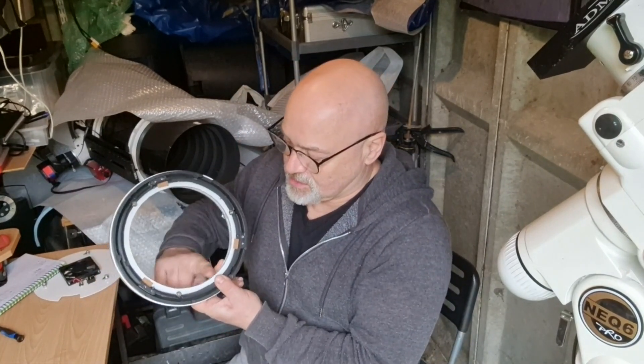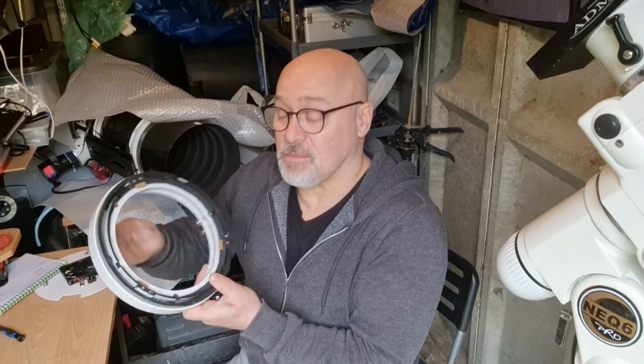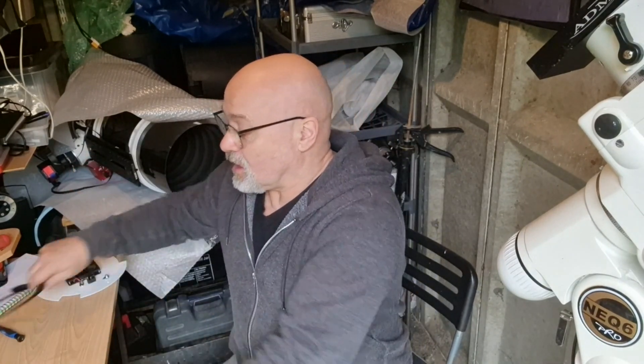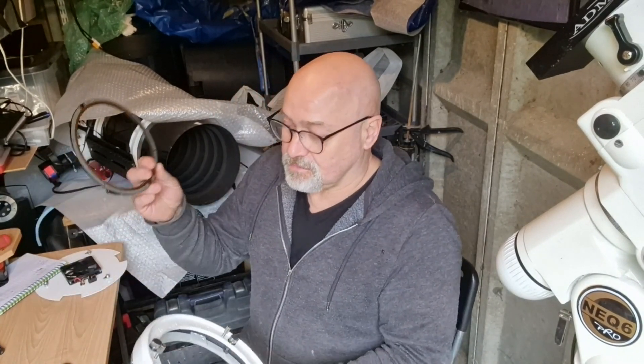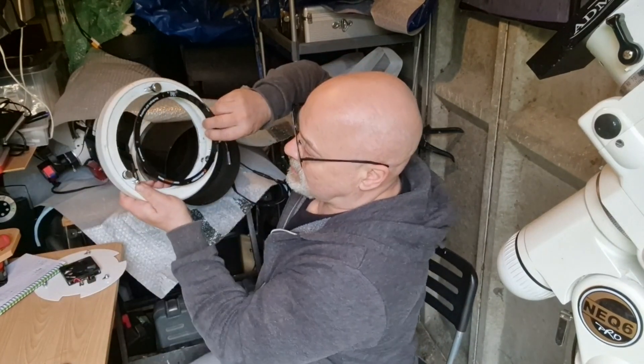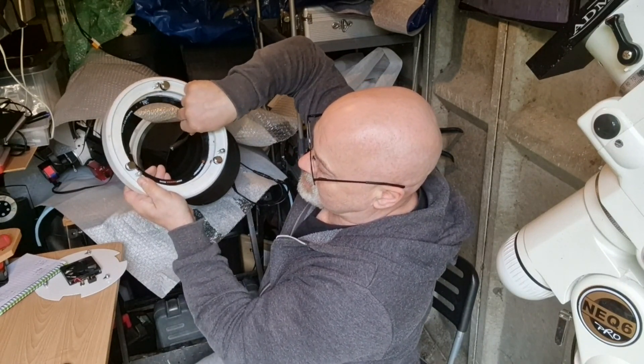The center is about six inches and that's the size of this ring I've got. It didn't quite fit so I've just had to, maybe a bit brutally, take a millimeter or two off — which doesn't matter because it sits on the cork anyway. The plan is when I mount my mirror back in, I'll use a bit of silicon sealant and it will sit on the glass right in there, still allowing it to move.